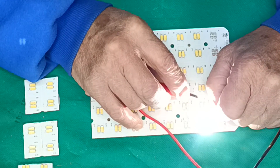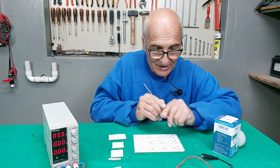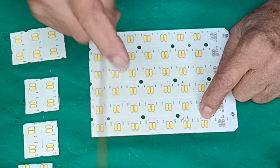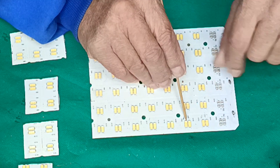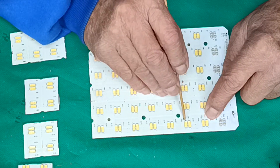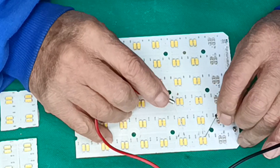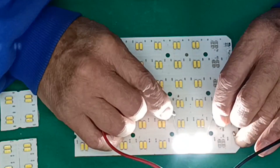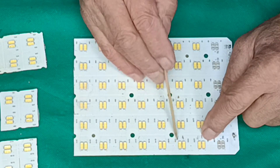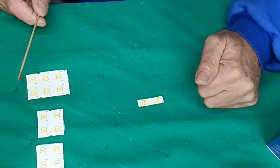And here both light up. So these two are in series, and in turn this series continues through the panel and joins another, doing the same. So between this point and this point I have 4 LEDs in series, which would total 12 volts. Let's apply 12 volts — negative here and positive here — and we see all 4 LEDs lit. So I can use these 4 with 12 volts. Here we have a group of 4 to work at 12 volts.